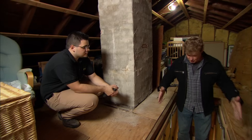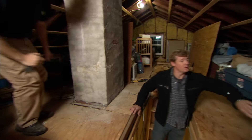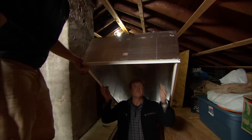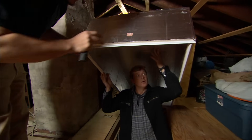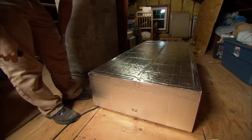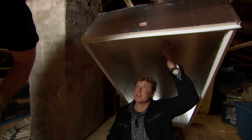We've got a gigantic hole right here, but we need it so we can't have a permanent seal — and it looks like you've got a solution. This is an attic stair cover, made of rigid foam board or polyisocyanurate, which is a higher insulation value than fiberglass alone. It's weather-stripped around the bottom so it makes a nice tight seal. When these stairs are up and not in use, this just sits over them and makes a nice seal, but when you've got to get access to the attic, the stairs come down and the hatch goes up. And we've seen these before — they're actually very effective.